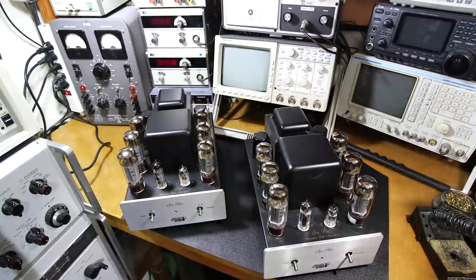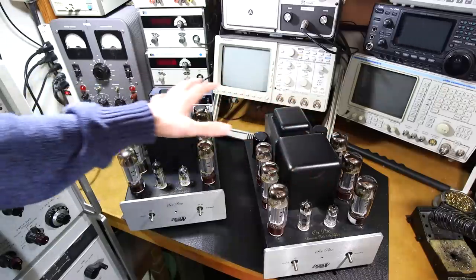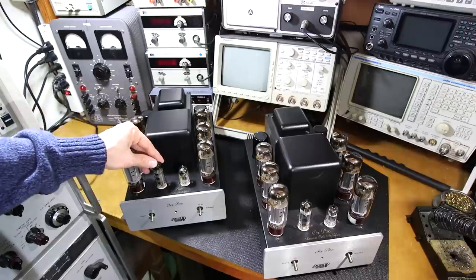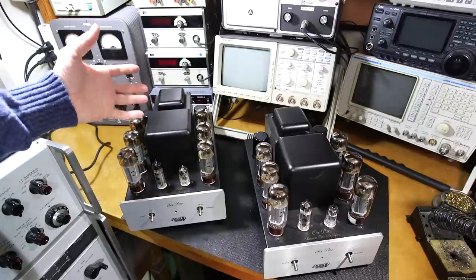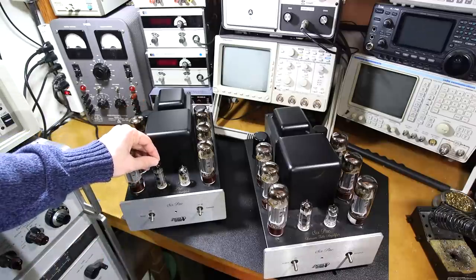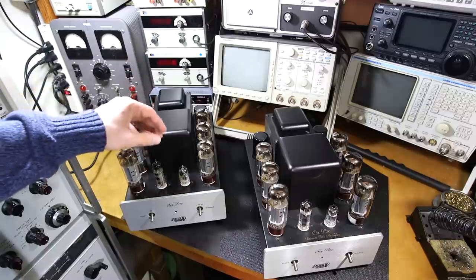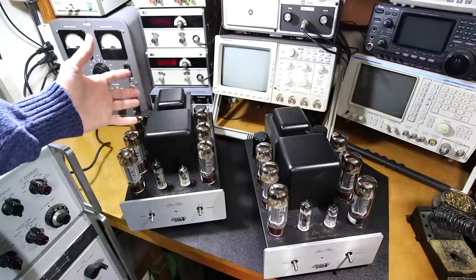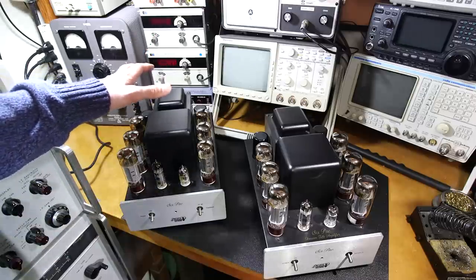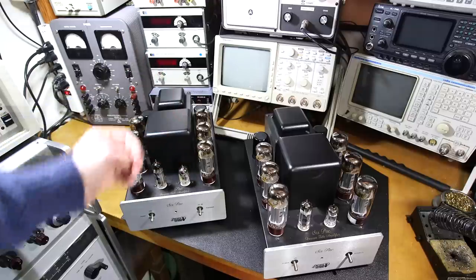Here's a look at the front side of these six-pack monoblock amplifiers — they look pretty impressive with all these output tubes, and I imagine they get pretty hot as well. These output tubes are EL34s or 6CA7s. This tube here is an EL84 vacuum tube. In many other amplifiers the EL84 is used as an audio output tube itself. What it's doing on this chassis I can't tell you yet, as I haven't drawn up the schematic. There is some talk online about what this vacuum tube does, but I don't want to repeat that without knowing for sure. This tube here is a 12AX7 — there's nothing written on the chassis because you're supposed to be able to try different tubes in the socket and experiment with the sound.